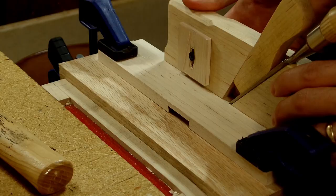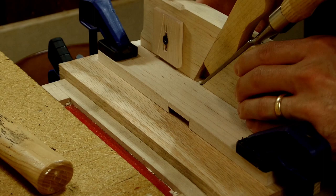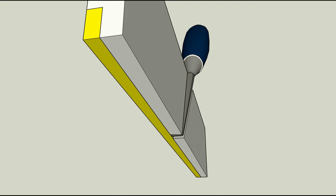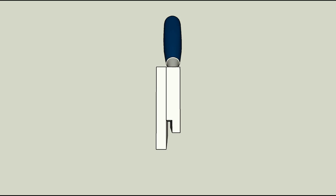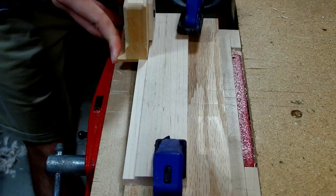Before I finish the main body of the plane, I need to make one last important cut. As the plane looks now, rotating around, you may notice it wouldn't be able to cut a thing — this extra material on the side would prevent the plane from cutting, as it would simply slide along the piece of wood I'm trying to groove. So in order to actually make a groove, we need to get rid of this extra material, thereby creating room for the chisel to cut deeper and deeper. By making this important cut, the bottom width of the plane becomes the exact width of the chisel. Then when I glue the fence onto the side of the plane, I'll be able to easily cut a quarter inch groove at a distance of 3/16ths from the fence and up to a depth of 3/8ths. To remove this extra material, I take the rabbit plane I made in the last video, set the fence to 3/8ths and the depth to 3/16ths, and easily cut away this unwanted material.